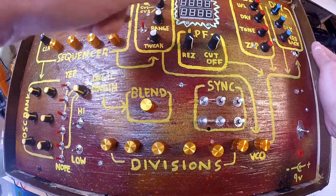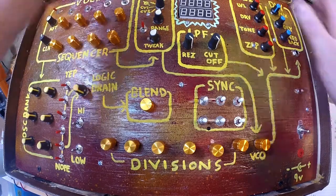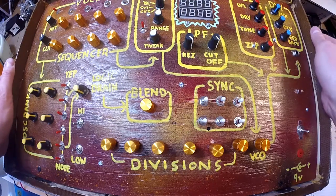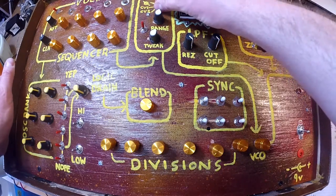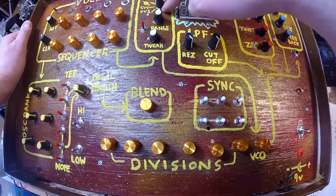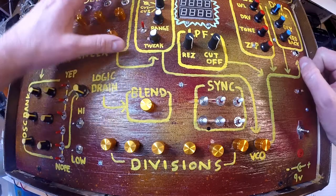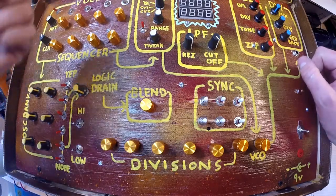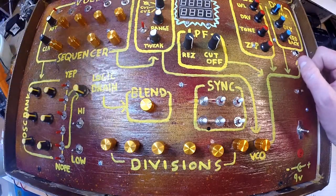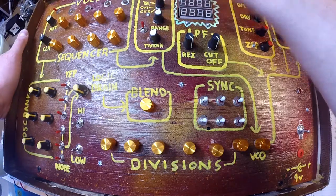Then I have my control voltage selector rotary switch here. It's basically off, but believe it or not, because it's all connected together, it's still kind of on despite me disconnecting the control voltage and the ground. The first control voltage point is right out of the voltage sequencer, and that also turns on the power to the switch. The second control voltage point is coming out of the voltage sequencer again, but through a diode, a little silicon diode, very cheap, and that just gives it something else to trip out on. So you've got your standard thing and then a wackier variation, or nothing.